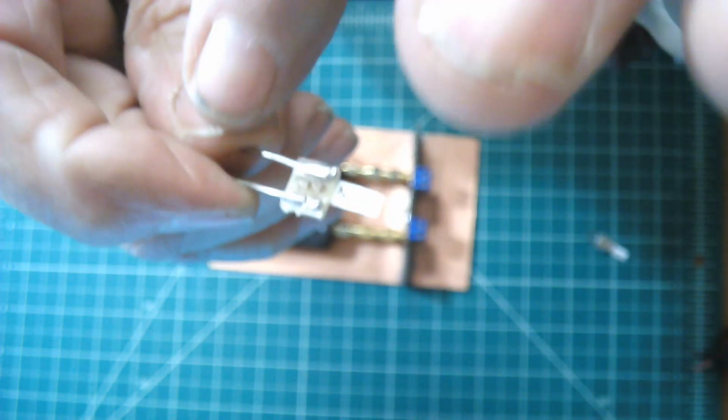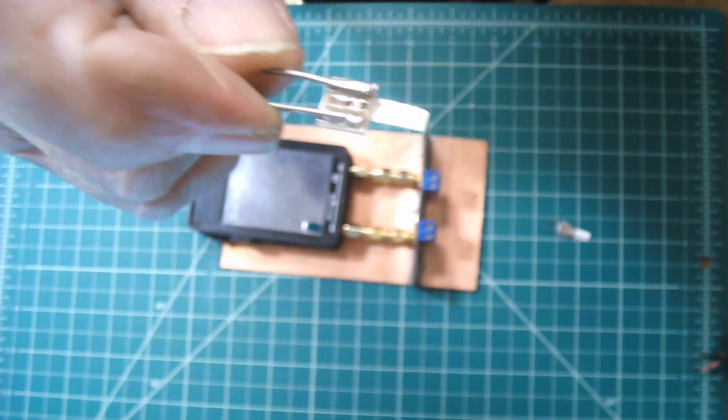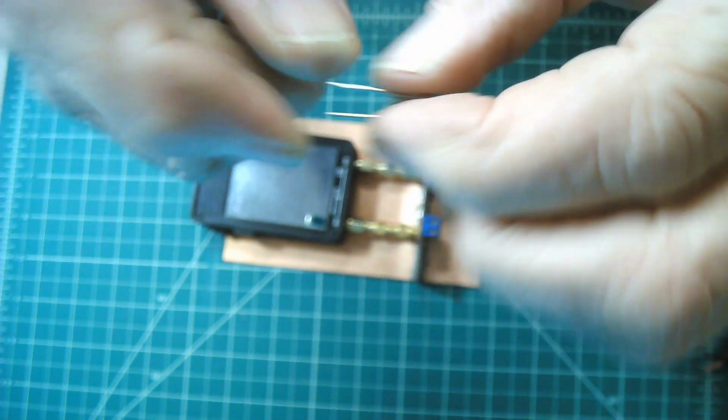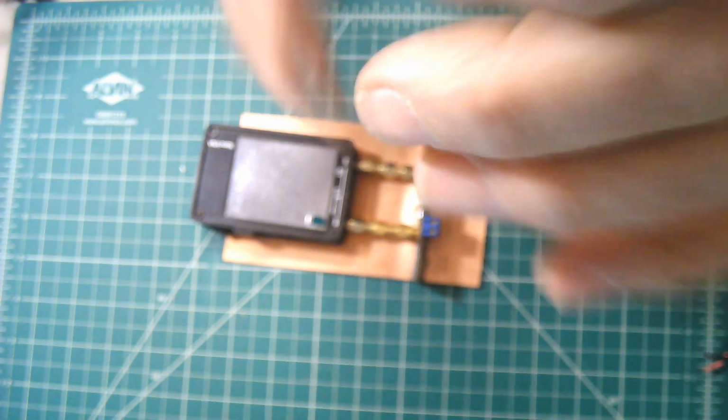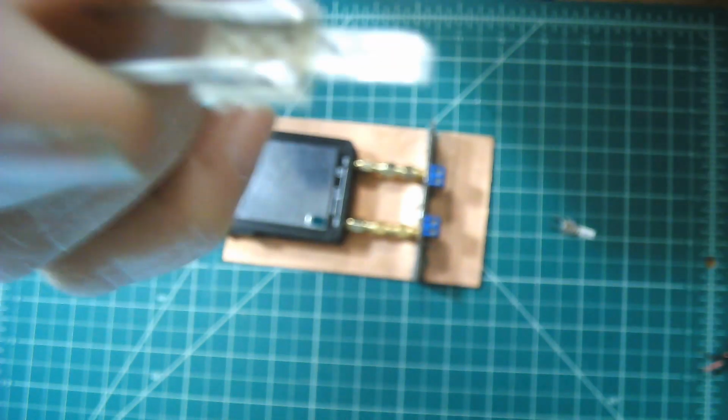What's this one? This is an open. You want to have this same thing that looks like this, because an open circuit is an open circuit, but they also have to compensate for the wires going to the open circuit. So whenever you have an open circuit, don't just disconnect the connector. Put whatever kind of connector you're going to have, only have it be an open circuit.